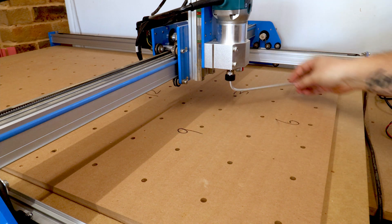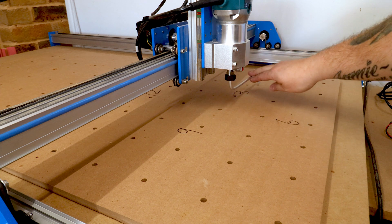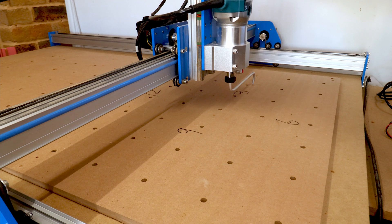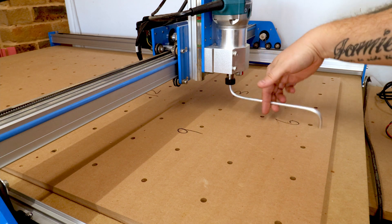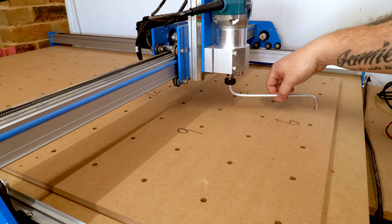I'm going to go around and work out where it looks higher — it looks like number three. I'll bring the piece of metal around to number three and bring the router down to just about touching. If I bring the metal around you'll see it's starting to catch already here, and the same on this side — it's starting to catch near the 12 and near the 6.